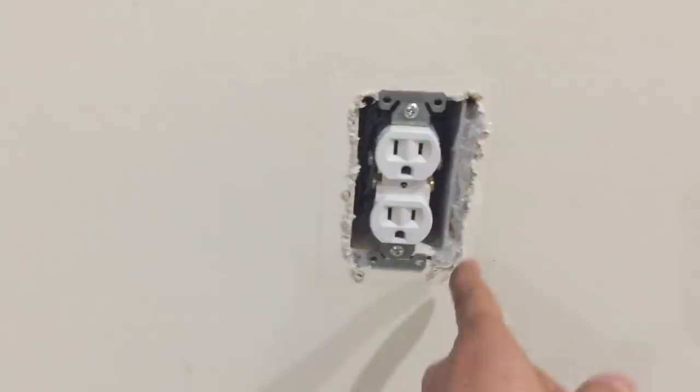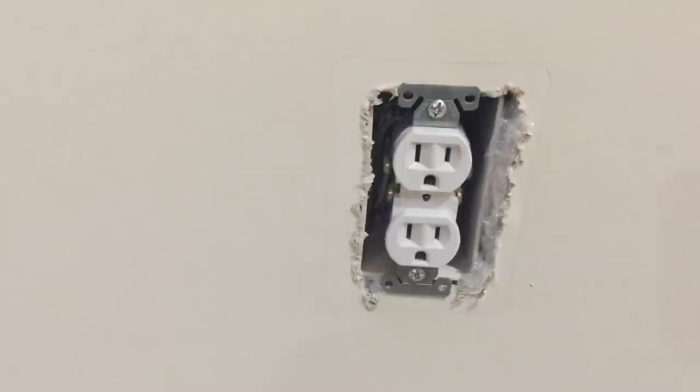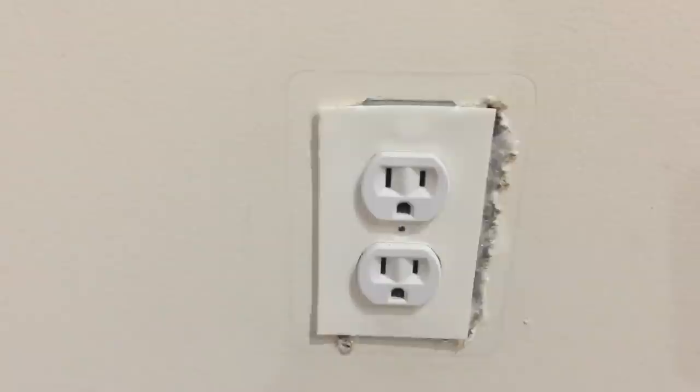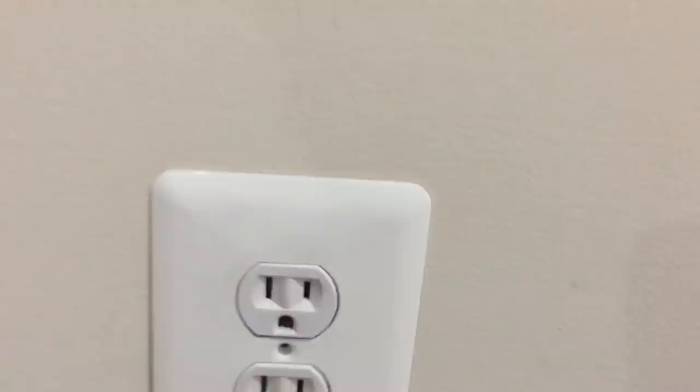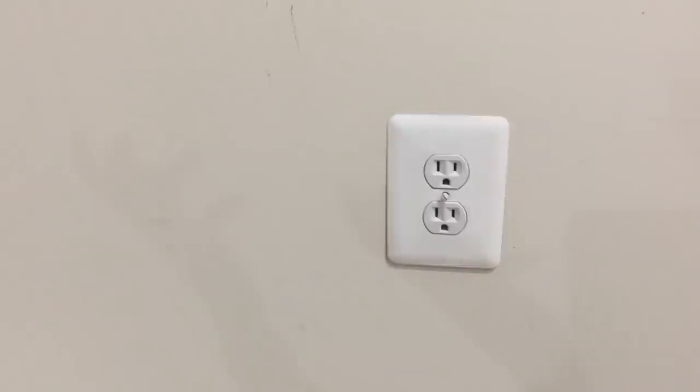For this one I actually had a little bit of a gap over here where there was a lot of cold air coming in, so I just took some spare bubble wrap, wadded it up, and put it in that gap to block it — that worked out really well. Then you just put the foam insert back over, put the faceplate back on, and remember to screw it in. This is the first time I've had metal faceplates, and you can really tell how cold it gets by how cold that metal gets, as opposed to a standard plastic outlet cover.